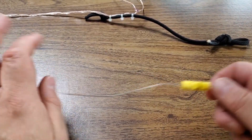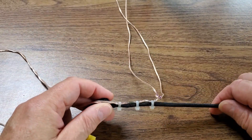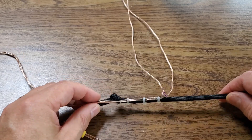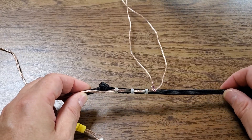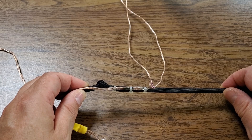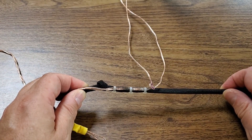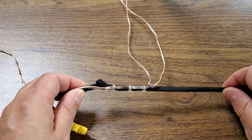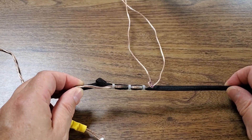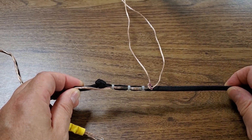And that's it. Really fast to build. You can probably put one of these together within an hour once you have the speaker wire, and you do not have to do any hard measurements. If you want it to be 7 megahertz, about 35 feet. If you're a foot longer or a foot shorter, it makes no difference. You will be using this antenna with an antenna matching unit, which will get the impedance down to where the radio is happy.